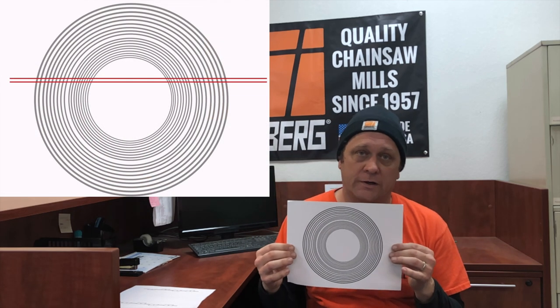Also, as a safety precaution, we leave the depth gauges a little bit higher on our ripping chain so they don't bite quite as much, and you'll get a smaller chip as a result of that as well. A lot of people want to know why chain dulls so quickly — that again has to do with the amount of work it has to do hitting every single one of these tree rings. Unfortunately there is no way around that; it's just the nature of the beast. We do recommend that if you're going to be doing a lot of milling, you get a backup chain.